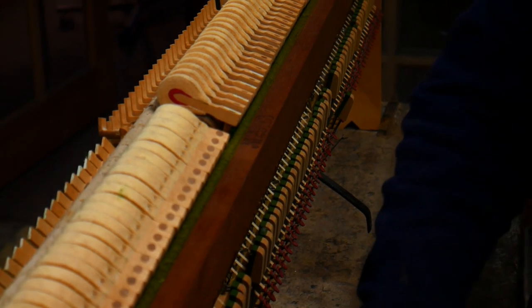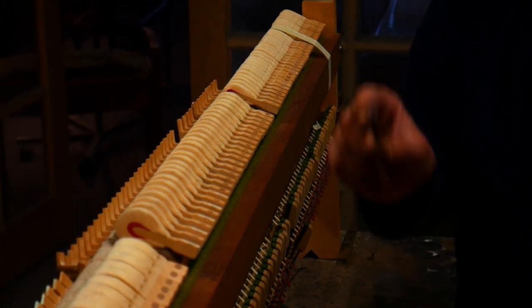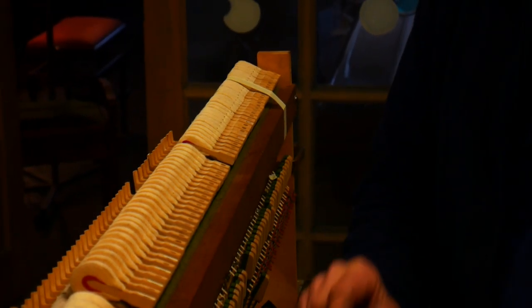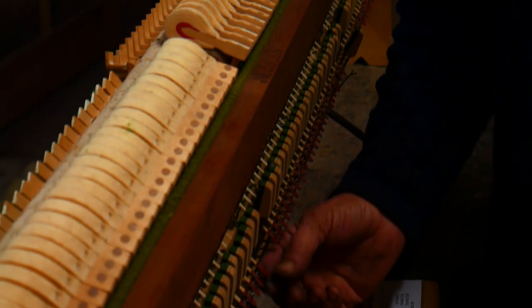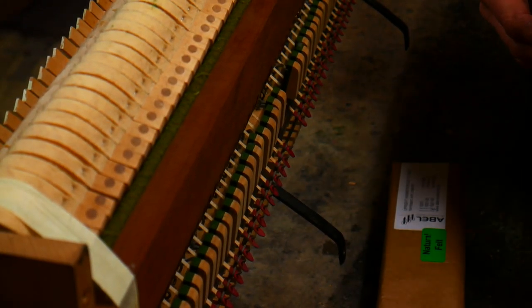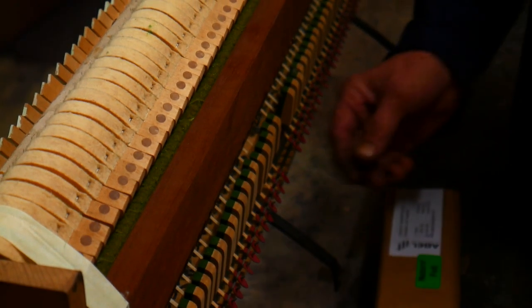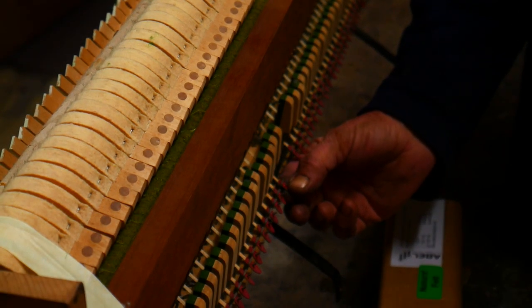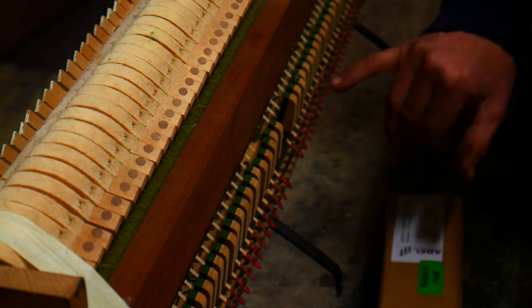And you'll often hear the bridle tapes or return tapes mentioned in pianos. The originals were Irish linen, little braid of Irish linen with a little leather cap. And even though they're still here, they will perish and crumble in time. They're not far off that now. But so we cut and replace new bridle tapes. The new tapes are a nylon material with a vulcanized cap on it. And I think we can safely say they'll last even longer than the originals.